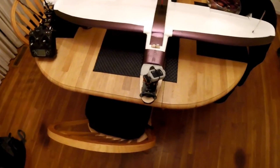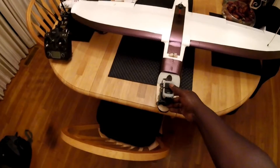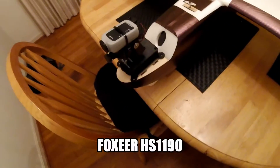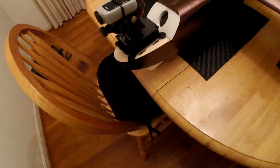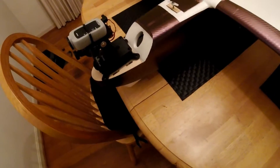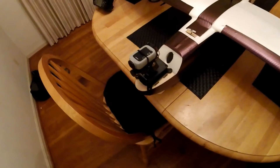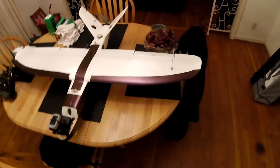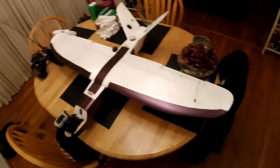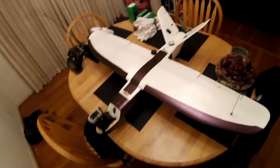On Propane two I think you get a bit more down-angle as well. I've got the HS1177 camera on it — I'll paste the exact name on the video — it's my typical FPV camera. I've got the Foxeer Legend v2 on this model, and this camera is mind-blowing, a lot better than version one of the Legend — the video is a lot crisper and looks a whole lot better. I'm using Dragon Link for the plane's control and 5.8 GHz for video.